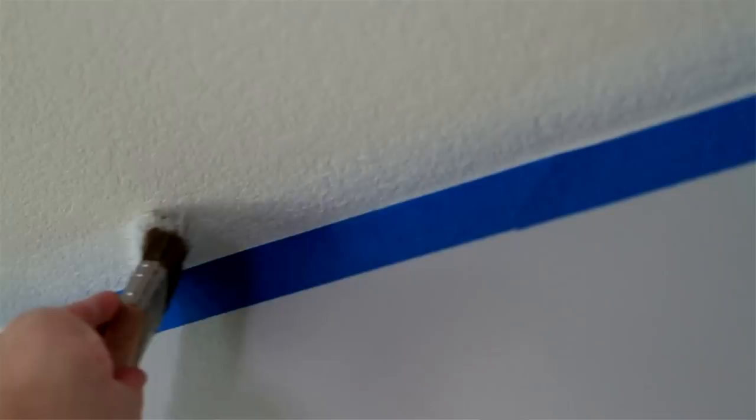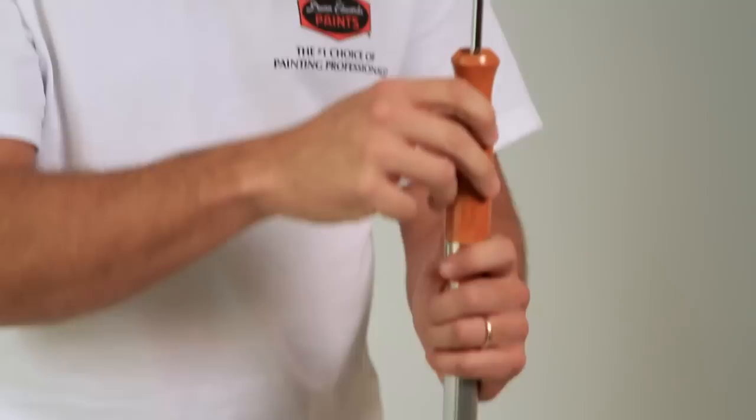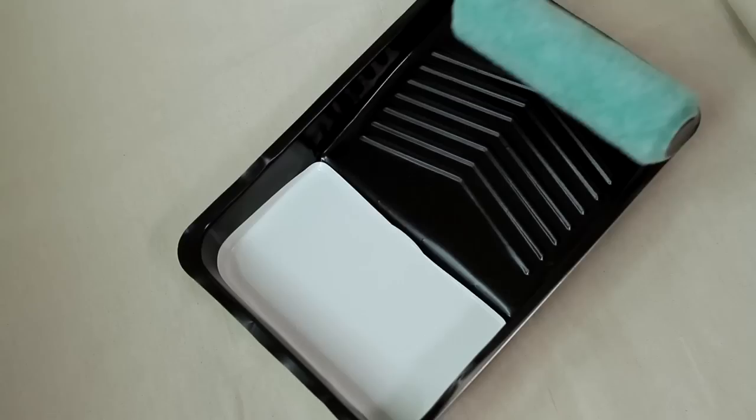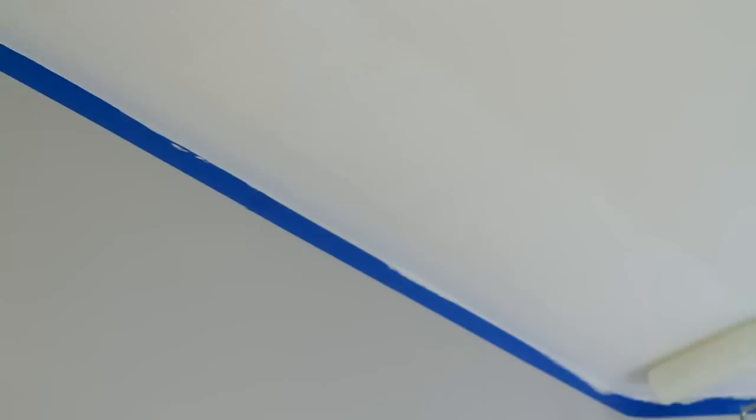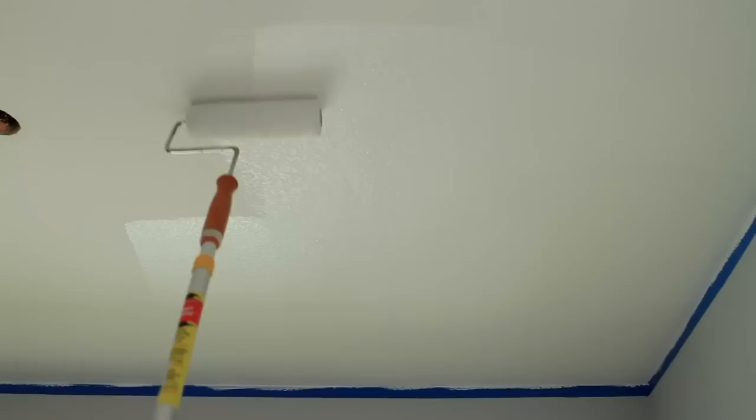The first step is to pre-wet your roller cover to dampen it before painting, as it will allow you to pick up and release paint more easily. Next, attach your roller handle to an extension pole. Then slowly submerge your paint roller into the paint tray, rolling it back and forth until the roller cover is evenly coated. Roll the ceiling in small sections, beginning in one corner and rolling across to an adjacent corner. Depending on whether you're painting the walls or not, you can use your roller to paint corners by simply rolling along the edge — this allows you to skip trimming corners with a brush and saves you time. Replenish the paint on the roller as needed to spread paint evenly until the entire ceiling is painted.